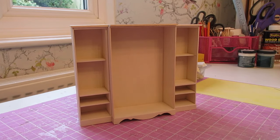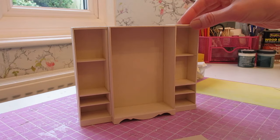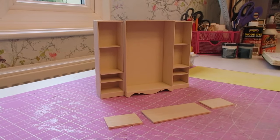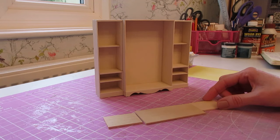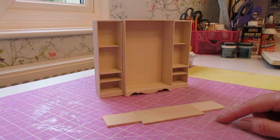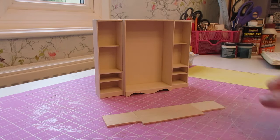You can now go ahead and cut the wardrobe top pieces — there's one piece in the center and then two end pieces. I did it in three pieces just because I think it's going to be difficult to get a really nice sharp bevel along the edges if we do it all as one piece. We'll bevel the thicker pieces, then cut one piece from 0.8 sheet wood as one piece — that will actually be easier to create the beveled edges on.